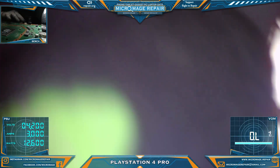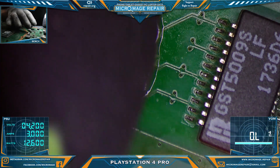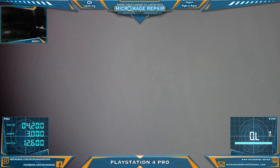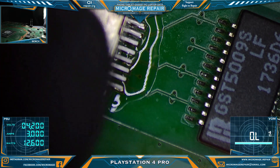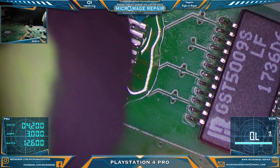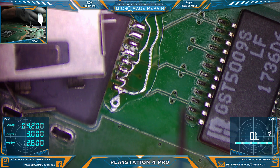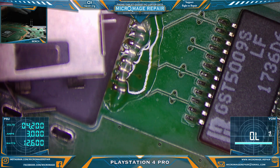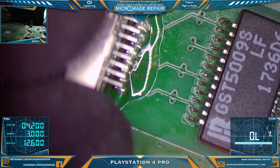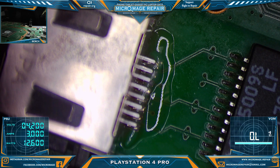This thing is actually sitting pretty good. I might actually use the Pico pencil after all. That last pull was everything not to do — I changed the nozzle on the hot air station and went with a larger nozzle, which created a melting mess. Luckily we're not trying to save that port; this is the port we wanted to save, and that one went smoothly. Do the first example, not the second.